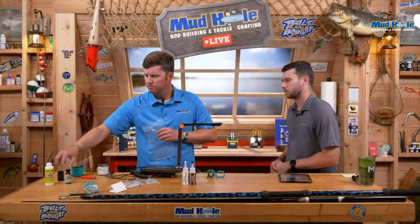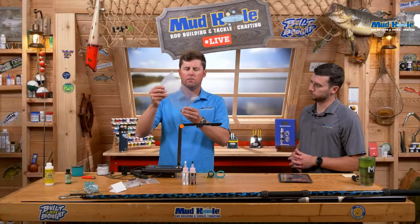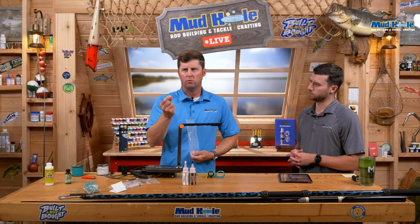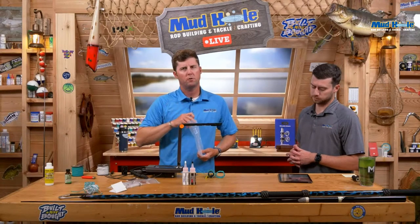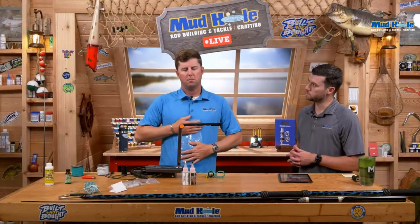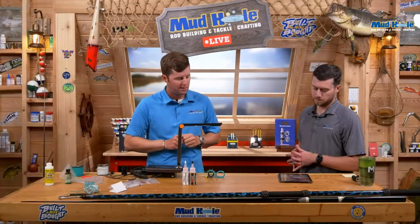When you get your jig, it's going to come with these little tiny screws. They have a little Allen key head in it. Don't ask me how I know, but you can also use a regular metric screw, okay? This is an M3. It's probably because I lost one or two of these little tiny screws and I had to go to Ace Hardware. I just took the jig with me and walked up and down the aisle until I found something that matched. So that's an M3. I think I bought an M3-16 or an M3-20, I believe. So there you go. Jot that down if you get one of these, because you'll probably lose one.